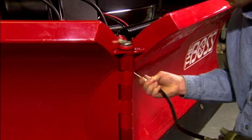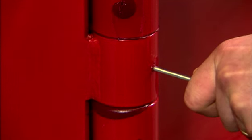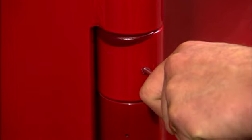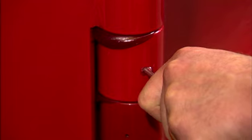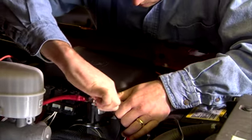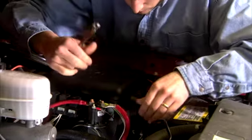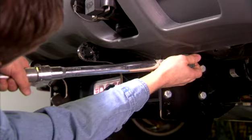And don't forget to grease the vertical hinge bushings on your plow. If you use your plow every day you should do this once a week. It's also a good idea to check your battery and solenoid connections and make sure the bolts on your undercarriage are good and tight.